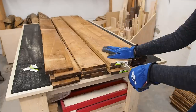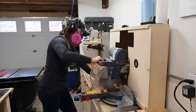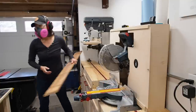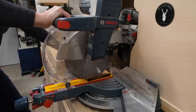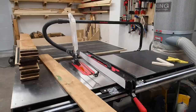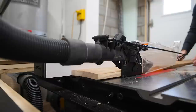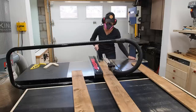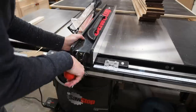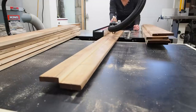To build this planter I'm using pressure treated fence boards. Cedar is also a good choice but I'm going with a more budget friendly option. I often find that fence boards are cracked or damaged on the ends so I'll start by cutting one end off all the boards to get a nice clean edge. My goal is to make consistent even slats with square edges. I'll first shave the edge off all the boards, then move the fence over to the final dimension and rip all my boards, getting two slats out of each fence board.